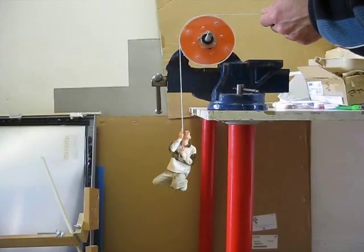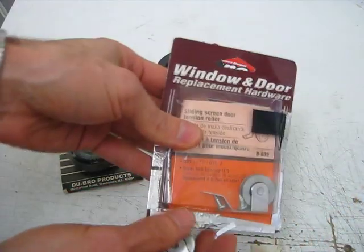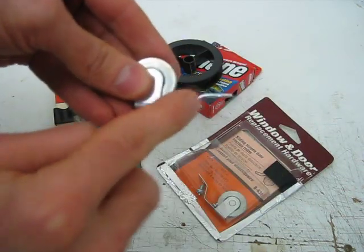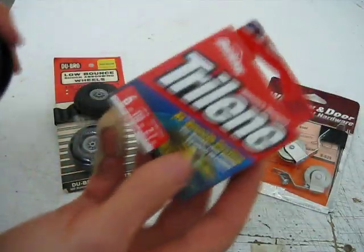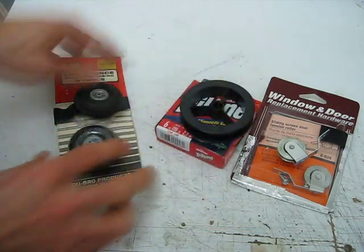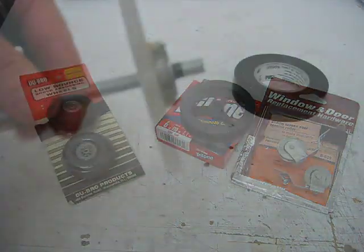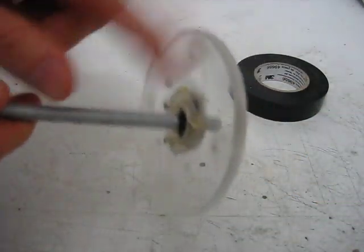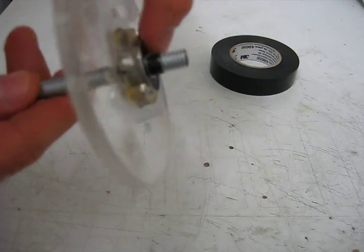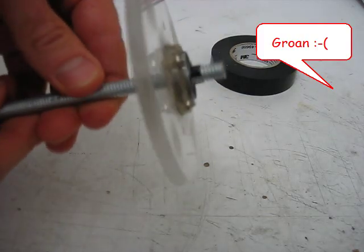Of course there are other secret things that can be used as pulleys. Here are a few other sources. This is a window and door thing — I guess it's for sliding screen doors. That's a very nice pulley on that, and you even have a mounting system right here too. This came off a roll of fishing line — so if you have a very flat belt you can use one of these. Wheels — the hub for wheels. Just take the wheel off, and inside there is a pulley. I just want to show you a little trick: if you have a shaft that's not large enough for your pulley and it slips too much, what you can do is just take some tape — I usually use electrical tape — and just wrap it around the shaft right there. And now you have a much firmer hold.